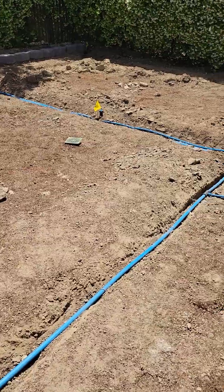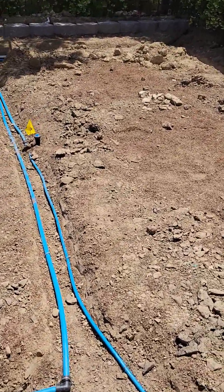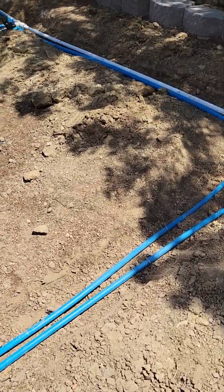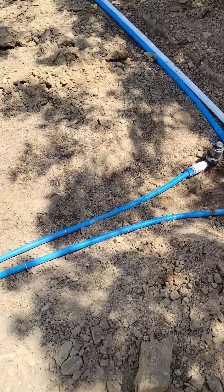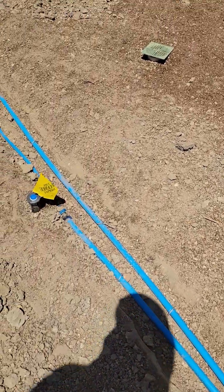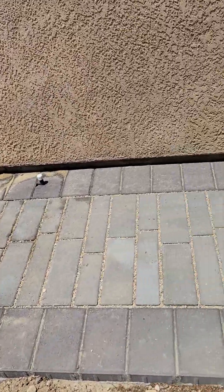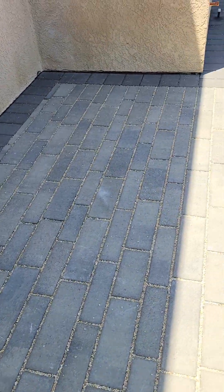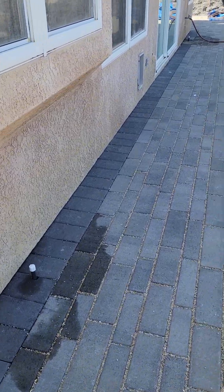On this side we have a setup where we're going with drip for the planters up in the planter bed area near the patios. We have patio stub-outs along the side of the house, with one line that has a pressure-regulated filter so we can have pots if necessary or have the option of pottery on the patio area.